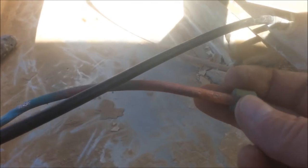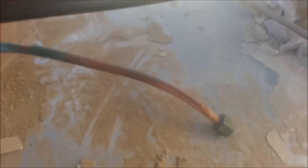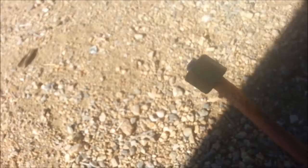As far as the water line goes to one of these floats, I'm going to be using a plastic one just to test it out over here. Usually copper is used for long term. This plastic doesn't last too many years — you're not going to get three, four, five years out of it max. So if possible, go with the copper line like this.